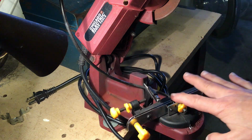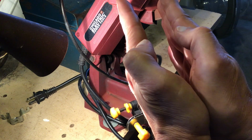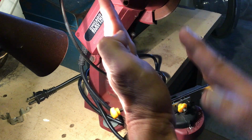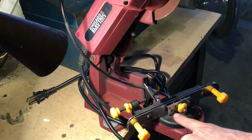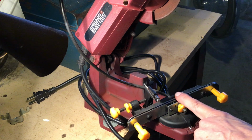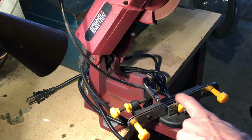But even then, once you put the chain in this part, it would hit the chain, and then the bottom, I noticed, would kind of move in, and I didn't really like that rocking part, so I actually put in a few washers under this bottom screw just to get rid of that rocking action movement. So now I had it clamping the chain properly on the bottom, basically, they call it drive teeth, gripping the drive teeth.